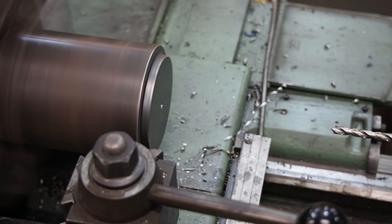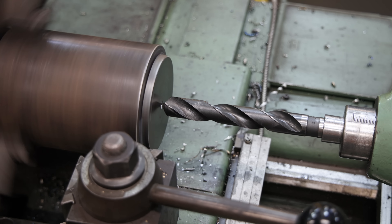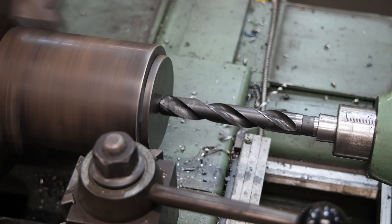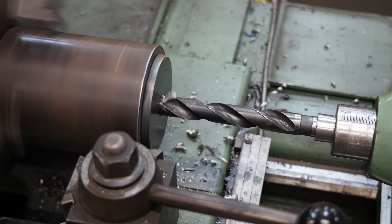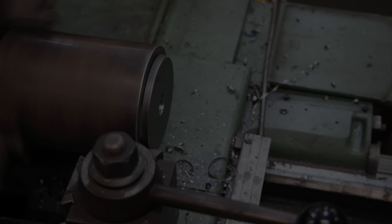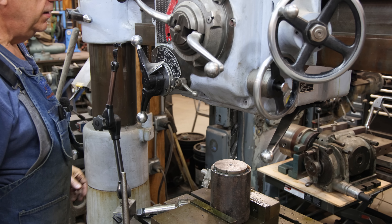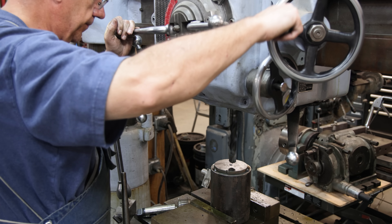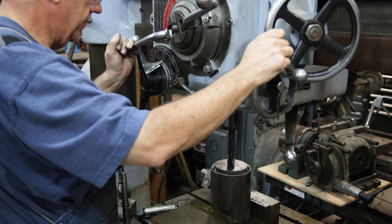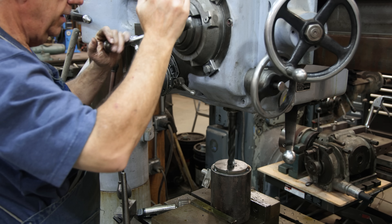I've got a long 3/8 inch drill bit and we're going right through to drill out the other side — that should keep us lined up on center. We're through. I'm going to do the same thing on the other piece, but first let's put the one inch hole on this side. One inch drill bit, I've slowed the lathe down to get the speed down, and we'll go ahead and drill this one through. To drill the other side I'll come over to the radial drill, find the center, and drill right on that.